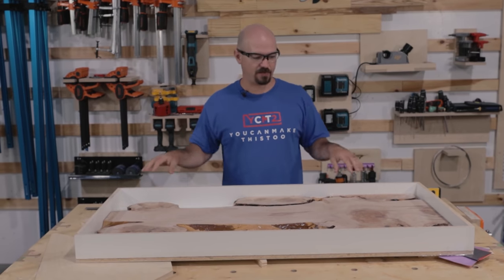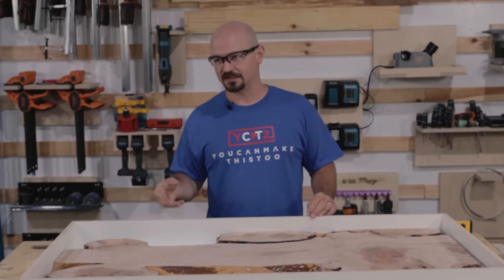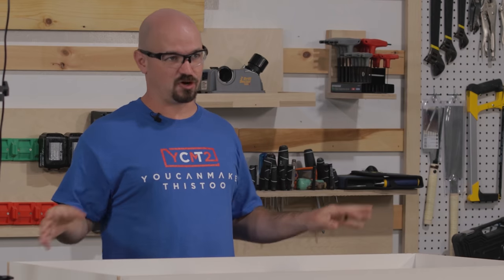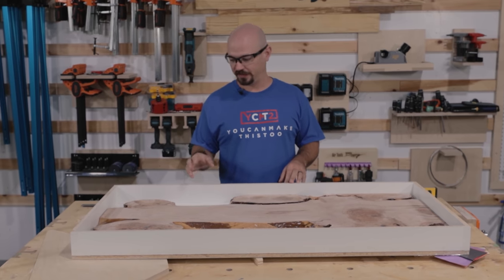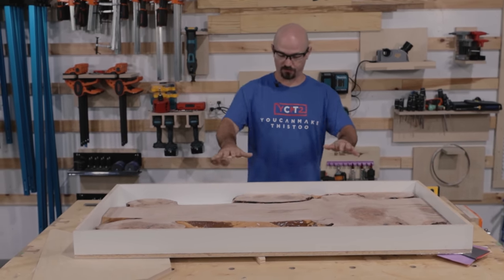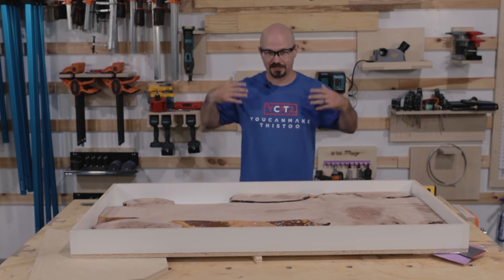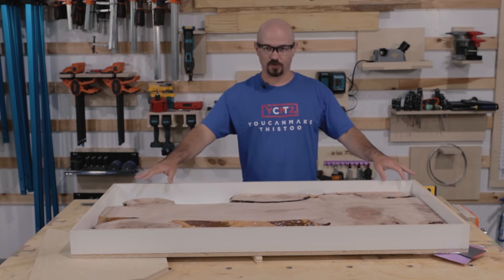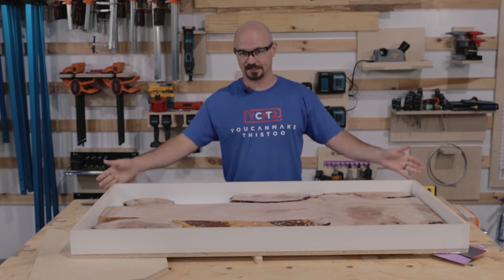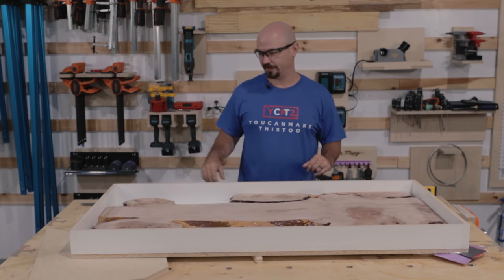Another thing to note about how we have this mold elevated, we're doing a thick-set pour with all epoxy. The big thing we're really chasing is the exothermic reaction, which is making sure that it doesn't get too hot too fast and then just turn into a hot mess. One of the ways that we can minimize the chance of that happening is making sure it can stay cool. If we just had this heavy 3/4 inch melamine mold on top of this 3/4 inch bench, we can't get any airflow underneath it. So when we elevated this, we're making sure to just catch the corners just as much as needed to get the mold up, so that way we have lots of airflow underneath. It's going to help keep the whole thing cool.